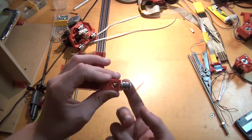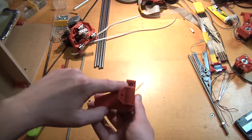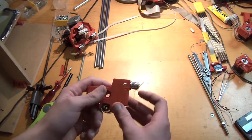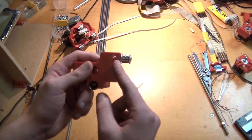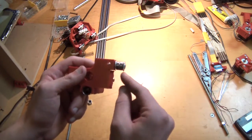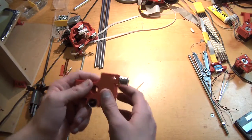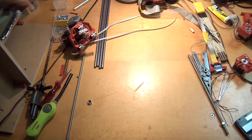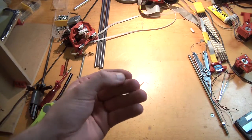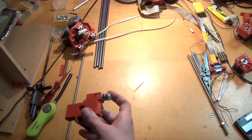Next you have to build this pulley right here. There's a nut trap on the other side where you put in an M4 nylock nut, and then it's a big M4 washer, a normal M4 washer, your two bearings, a normal M4 washer, and a big M4 washer. Be careful with those normal M4 washers — if you look at them and feel them, they have a smooth side and a rough side. The smooth side should point in the direction of the bearings, otherwise the bearings might not turn smoothly.